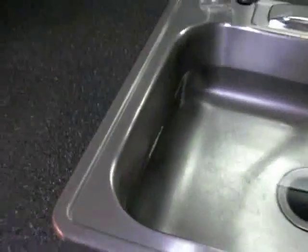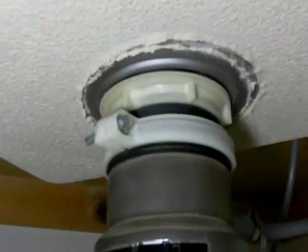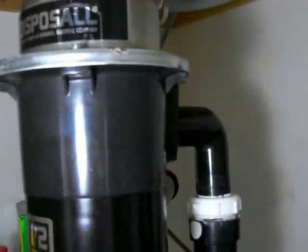Okay, here's the test. I filled the sink with water. And I dried the water at the bottom here. So that's good. So that shows that the new seal is not leaking. So I think it's got to be maybe like where that white ring is there. And I think the plumber's putty, between setting a dish on that ring here and this garbage disposal, between those two, that's got to be what gets the putty to deteriorate. So what I'm going to do now is turn on the water, remove the plug, turn on the garbage disposal, and we'll see where that water comes out.